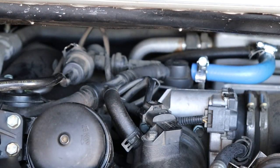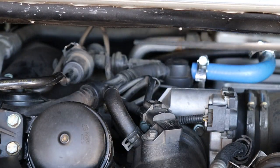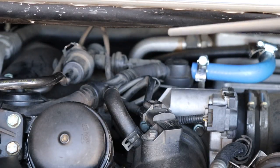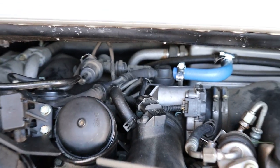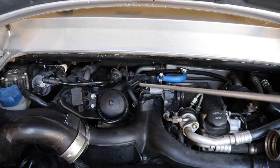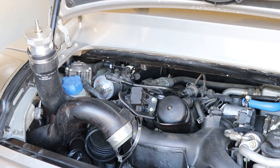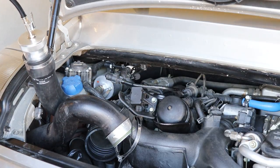We've lowered the engine quite a bit, and I think the number 16 check valve is right here — this little valve. This is the one I think is allowing air back in and making it sound like the air is leaking over on that side, because it's coming back through this and coming over here. The Venturi is right in front of it, right here. I'm going to put some air through this and see where it's coming from. We've got the mic in there so you can hear.